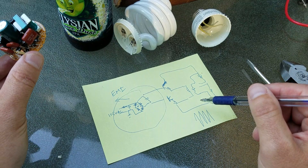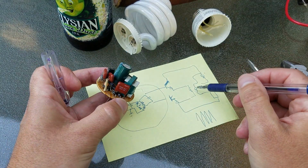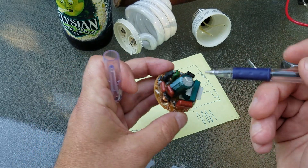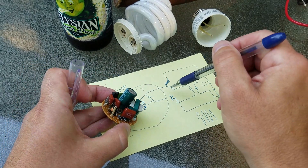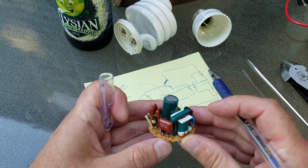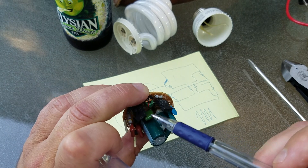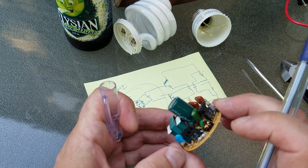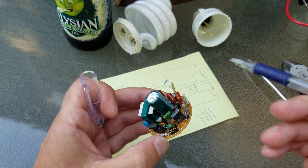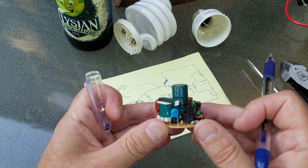This part is really well described — it's probably basic entry-level engineering — but no one ever really explains how the resonant outputs are established by the various shared inductors. There are capacitors in here that resonate with those inductors, and the circuit is somewhat mirror-imaged about the two filaments. I haven't seen a good description of how you set up the resonance such that these transistors or MOSFETs are operating in their ideal Q points. I don't know if they just set up computer models and tweak values until they work. There's biasing with these resistors — I was never good at microelectronics and don't intend on covering it fully in this video.